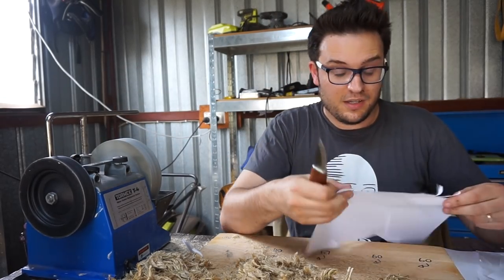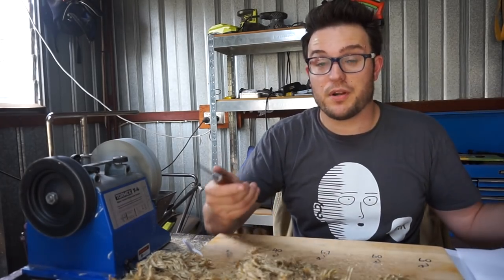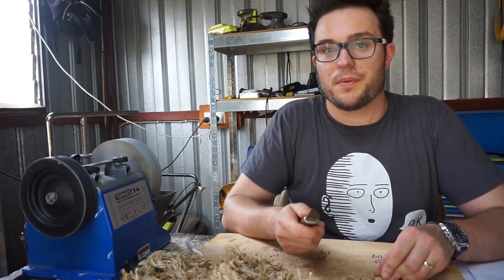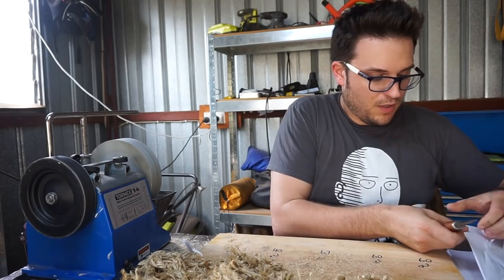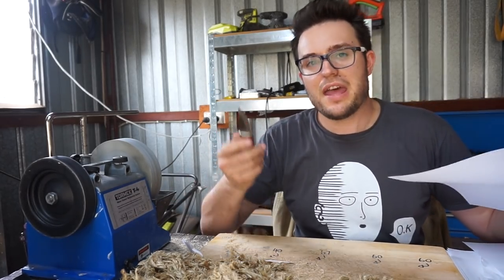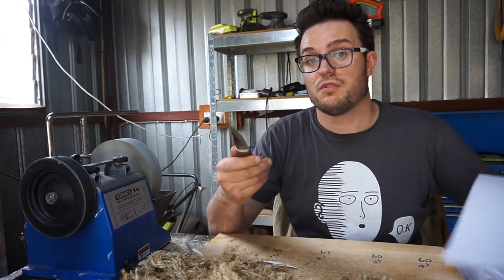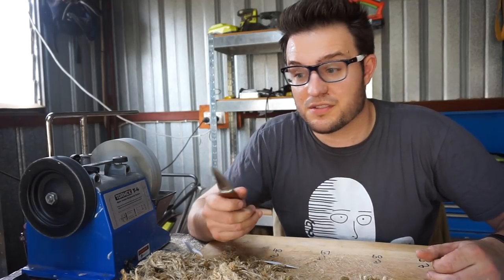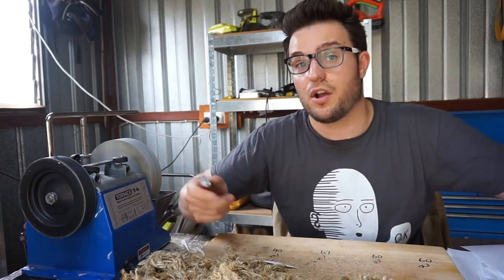So it's a simple strop on each side — let's have a little look and see how it improves. Pretty much back to square one. And even pushing through the rope again feels great. It just goes to show that my rope cut test isn't everything, because with a few seconds I've probably reset the edge. Edges gradually do fatigue with stropping over and over — you eventually do need to remove some steel. But if you're using this as your primary knife with a belt and some compound doing your bushcraft, you'll probably be able to rejuvenate it every three hours or so after use.